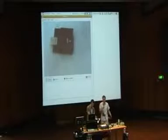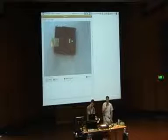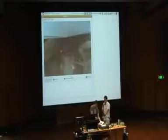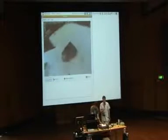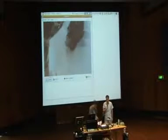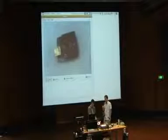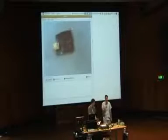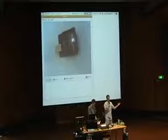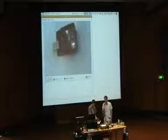But there are some extreme limitations that are being dealt with in trying to implement this sort of thing. The big problem is that a TCP/IP stack is actually reasonably complicated. And so the library that is supplied, for example, with this new electronics board allows you to do things like open a network connection, but it can't handle multiple packets. So if you want to do something like run a little HTTP server, which you can do out of using one of these, in fact I've done it, you can even run a little CGI thing so you can send values to it, you have to make sure that your entire response fits within a single packet. So there are certain limitations you have to work with.